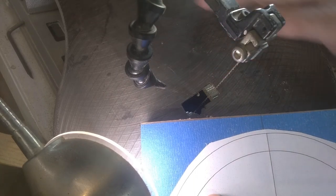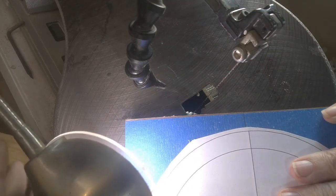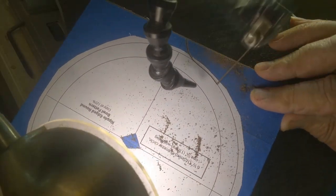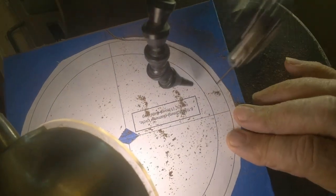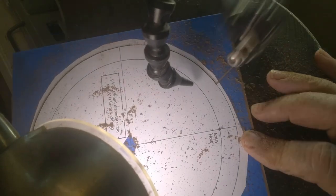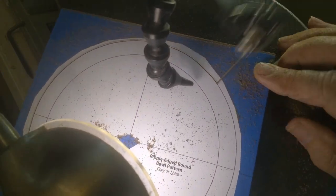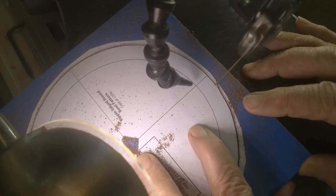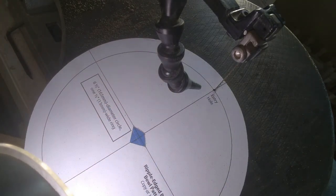I've got my table set at 30 degrees. I've got a number nine blade in there because I'm a little concerned about that knot — it may give me some trouble. I'm not going to cut real fast; I'll take it easy because it's kind of a steep angle. That cut went real well; I couldn't even tell the knot was there. I was so far away from it, I don't think it made a lot of difference.